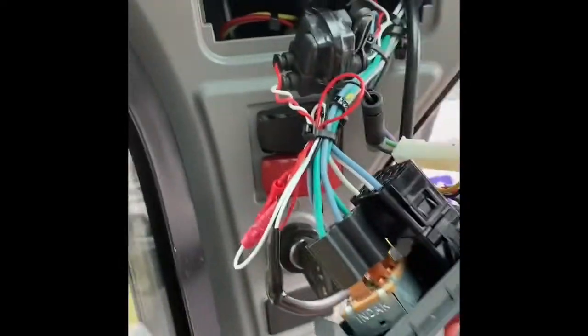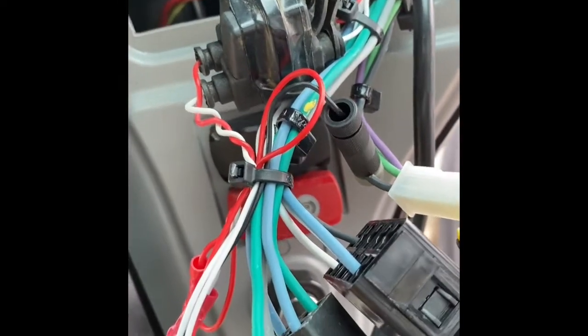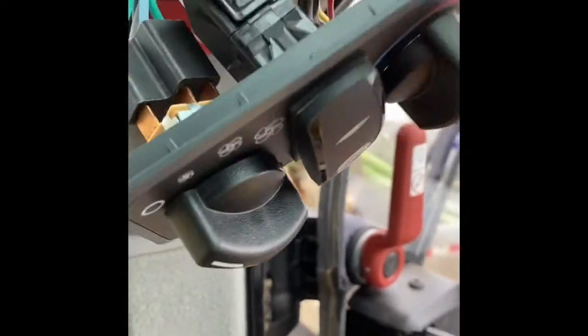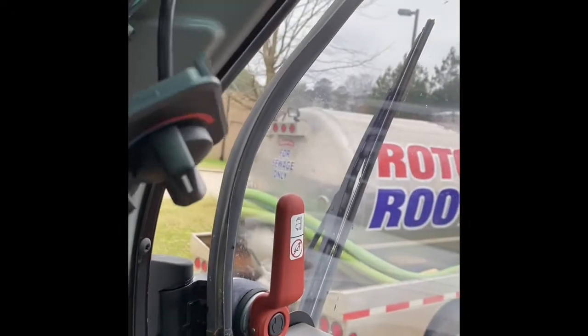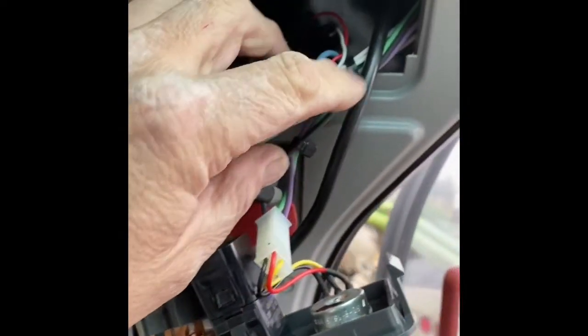As you can see, the fuse is zip tied and taped up. We've got all our wiring bundled inside with no strain on any of our wiring. Our ground is very nice — we checked the resistance on that. We'll probably add one more zip tie here, just to make sure that if anybody yanks on this cable, it doesn't rip out any crucial wiring for the machine.